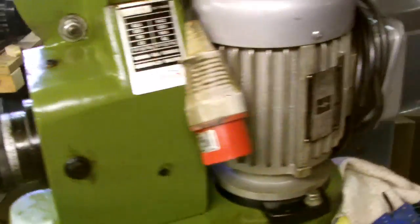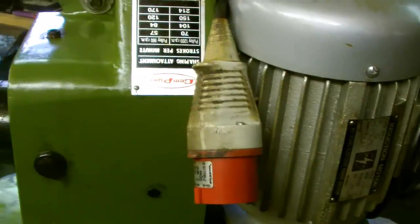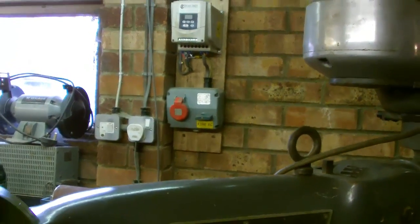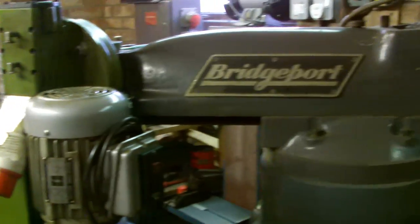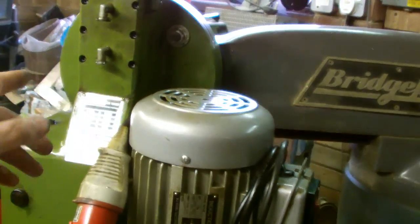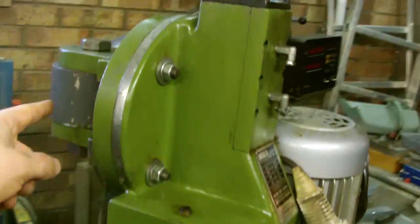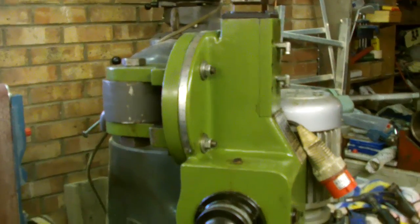So that's something else I've got to build today - it shouldn't take too long. As you can see, it does look a bit strange when it's upside down. Nice three-phase plug which will go straight in there instead of the normal milling quill. The easiest way for me to actually mount this to the Bridgeport was to rotate the whole ram round and stick this end as close to the table as I could, then winch the table up until this bracket was just at the right height and move it into place.